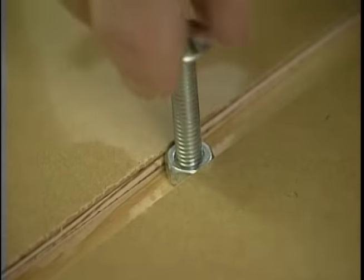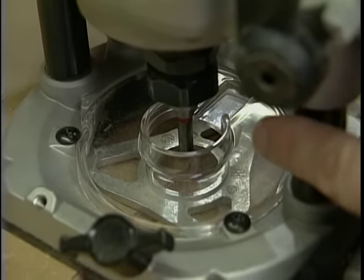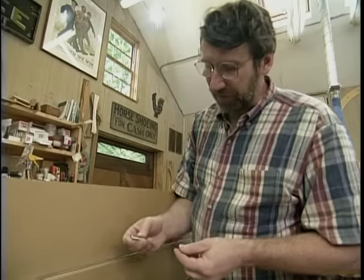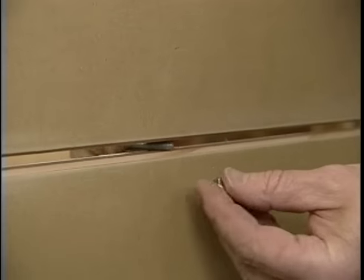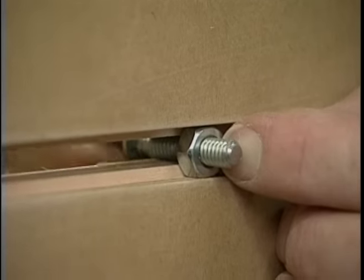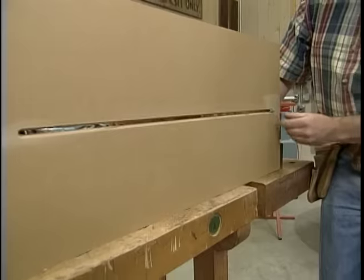That's perfect — now the nut won't spin when I tighten the screw. I've made a couple of changes to my router: installed a smaller diameter bit, this time a quarter inch, and readjusted my fence so I can make a through slot right down the center of that dado. What I have is a quarter-inch bolt with a straight slot screw head that goes in from the underside. Then I put the nut on, slip it into that dado, and tighten it up. I can move it up and down this slot for quite a range of different radius cuts.